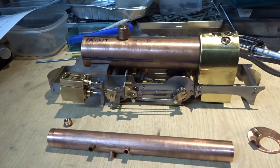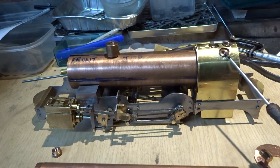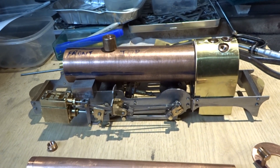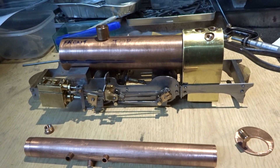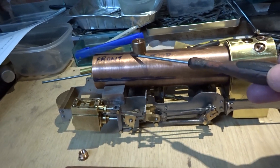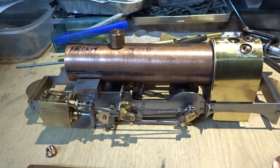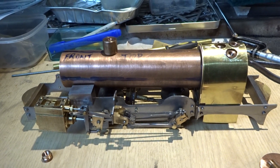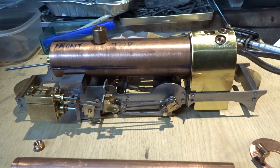These are some of the boiler bits just loosely assembled - not soldered together yet - on the locomotive frame. Various bushes will be for the water glass. That's for the safety valve. This one here will be the turret for the steam controls - that's not prototypical because the prototype had controls attached to the back head, but this is so small I balk at trying to get all that in. There's very little water space in this thing. This large bush, which won't be seen ultimately, is the bush over which a dummy steam dome will be fitted. That bush will contain what's called an E-knot valve, which is a supplementary method of filling the boiler with water when it's under steam, to supplement the axle pump which is down here in the middle, should that fail.